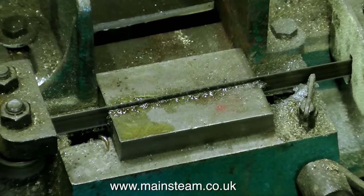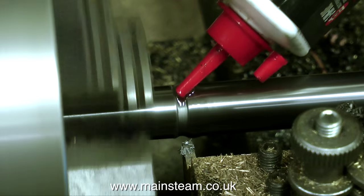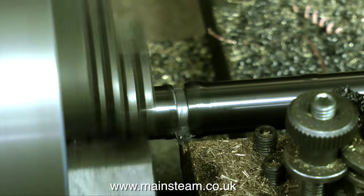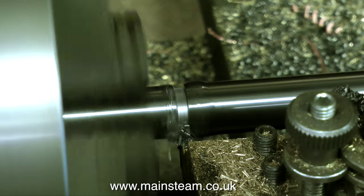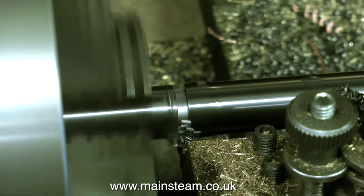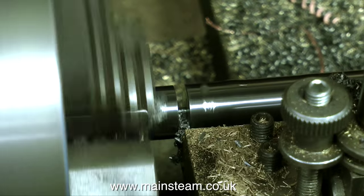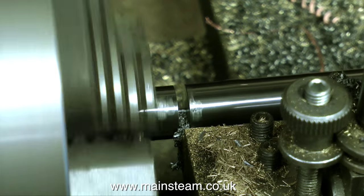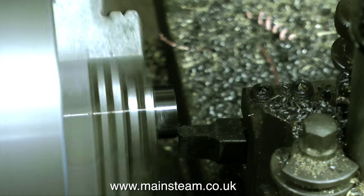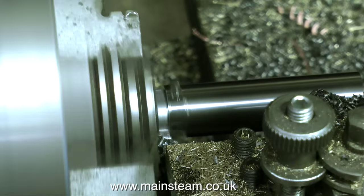While I'm doing this, I'm using my bandsaw to cut the crank webs out of a block of steel. The first thing to do is to part off in the lathe a piece of 3/4 inch diameter silver steel. I'm using silver steel for this crankshaft for a couple of reasons: it's a ground material and dimensionally accurate at exactly 3/4 of an inch, and it's quite hard and wears very well. This kind of steel can be heat treated to make it really hard, but I don't need to do that.